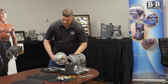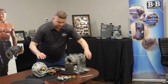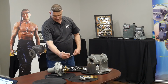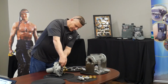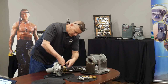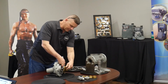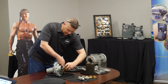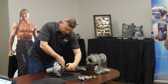Okay, and it's as easy as this to change out the capacity, like we're going to change throttle plates. You hold the stem, because you don't want the stem to rotate, because it's basically connected to all the assembly as it moves up. It's got a notch on the stem that allows me to do this. Then I just loosen this stem nut. Sometimes if it's sticking, you have to gently pry with a light screwdriver or something, but you just pull the plug retainer off. Usually you get it started, it'll come right off.